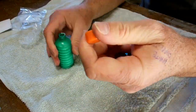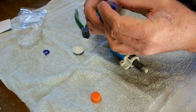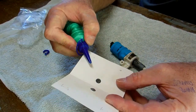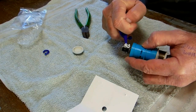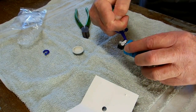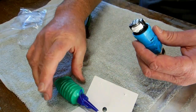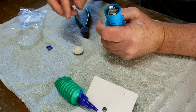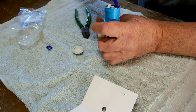So this is the silicon grease. Never used this before, so no idea how to use it — just like silicon. The idea is to fill up that little compartment in there with the silicon grease that slows down the lid coming down and the seat coming down. So fill it up pretty tightly with that.